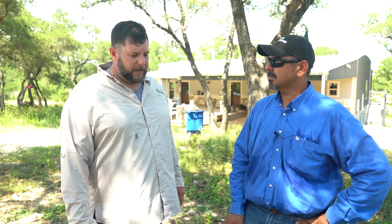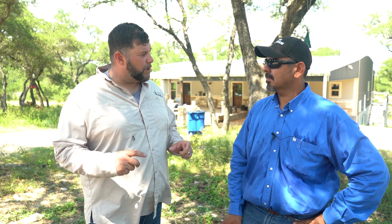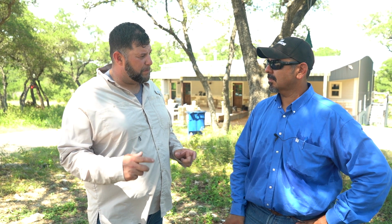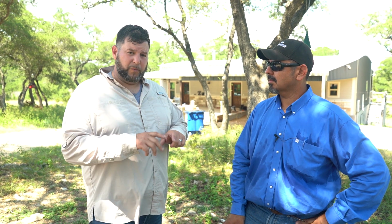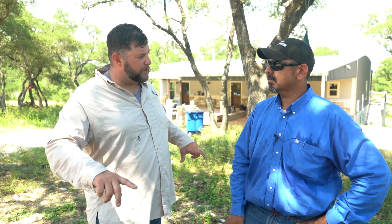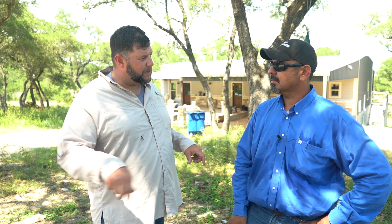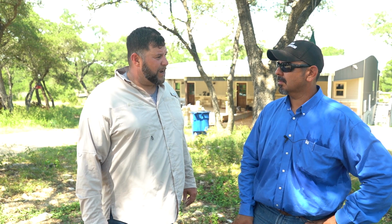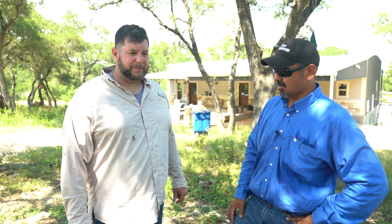So what we're going to do today is go up there and reinforce all your seams, and cover all your turn bars and all your bolt heads with a fully reinforced, single component urethane that saturates a piece of fleece. We're going to lay down our resin, then put a piece of 165 gram weight fleece into the wet resin, then top coat on top of it. When you're done, it's going to be about 80 mils dried, and 16 hours will be cured. In about 2 hours you're watertight. Wow, awesome.